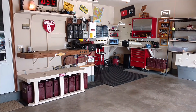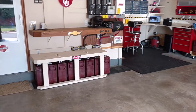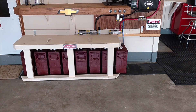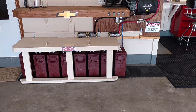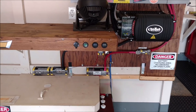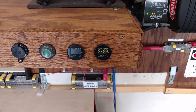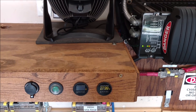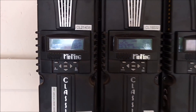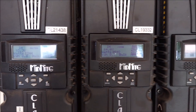First off, I'm very thankful I made that cart — you know, rolling around 400-plus pounds of batteries. Everything is fired back up and nothing blew up, nothing arced. Normally I'd get an arc fault on the Midnights, but that didn't even happen. The battery bank voltage is sitting right at about 28 volts right now. Up here are the three Midnight Solar Classics, all pumping energy down into the batteries.